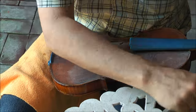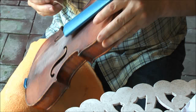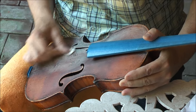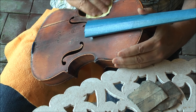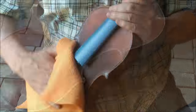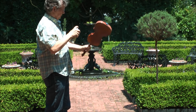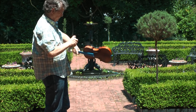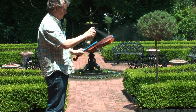Give it another sanding between coats. Now I'm at 320. I'm fond of spraying the lacquer from a can like this, but if the nozzle is even slightly dirty, it will give you a bad spluttery finish, so buy extra nozzles.